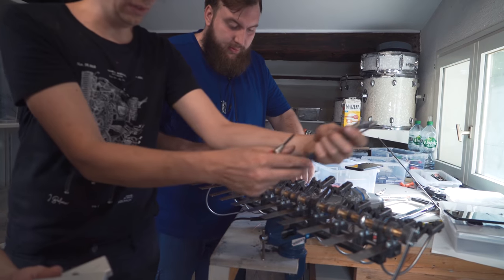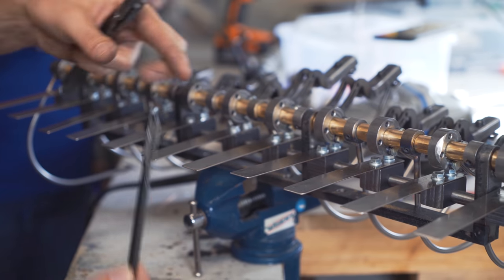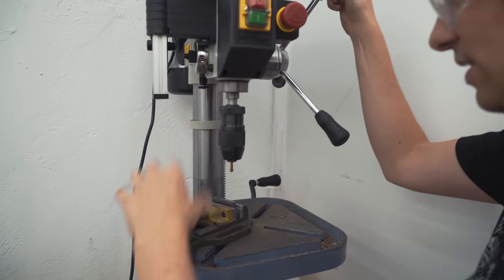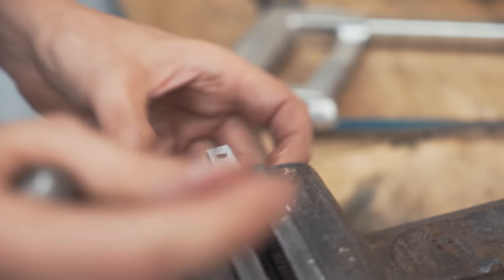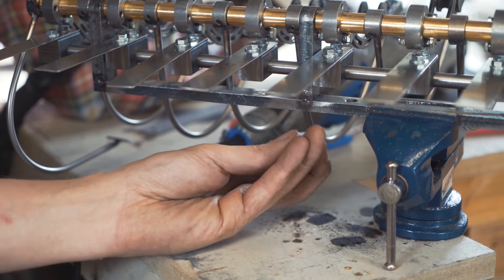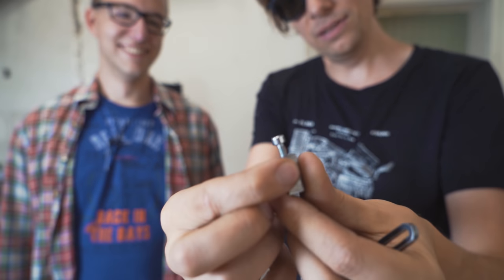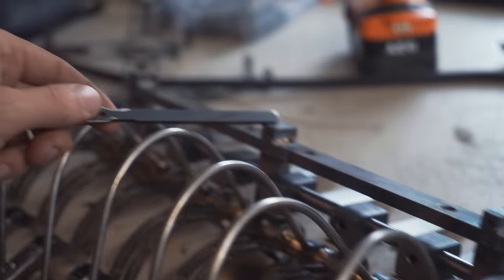We're opening this up because we have to drill and tap some threads for these adjustable slots that are going to support the positive stop that makes all the vibraphone plates be on the same level. So I'm making four metal blocks with M4 threads. I learned from Alex that if you make a chamfer the tap is really easy to start. Now I split them - four blocks with a thread. This block with a thread is going to be welded on underneath. I did my best job to weld them on as pretty as possible.